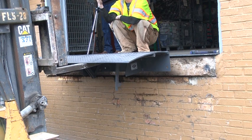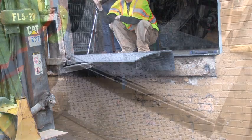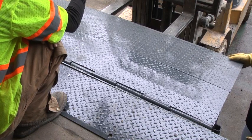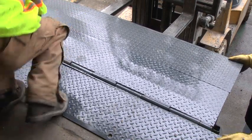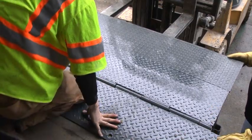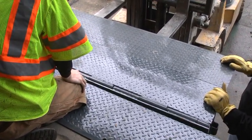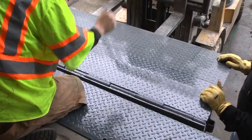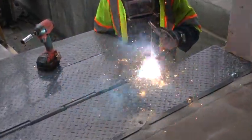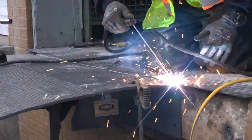The leveler can be raised into position by forklift. Place the center plate and lip plate flat on the forks with the base plate hanging vertically, and raise the leveler so that the base plate is flat to the face of the dock. Locate the top edge of the base plate approximately one eighth inch below the top edge of the approach plate. Since it is very difficult to get the base plate perfectly level, get one side in the proper location and tack weld the base plate to the approach plate, then raise the other side to the desired location and tack weld that side.